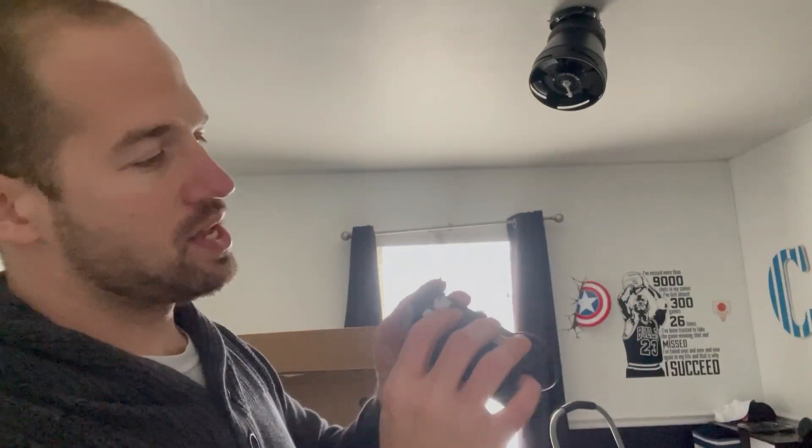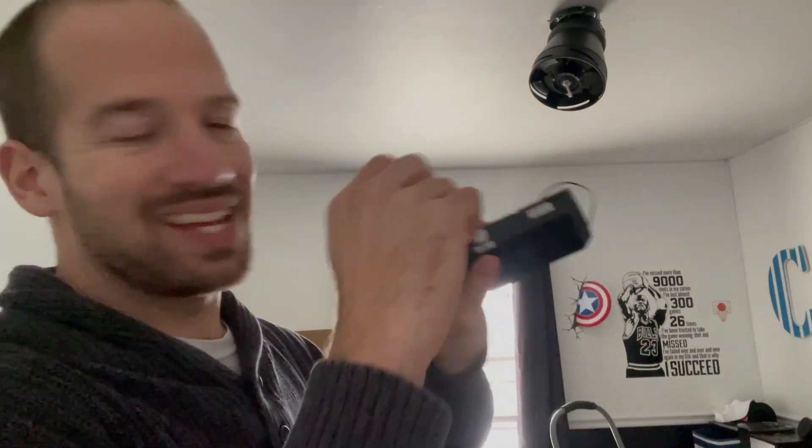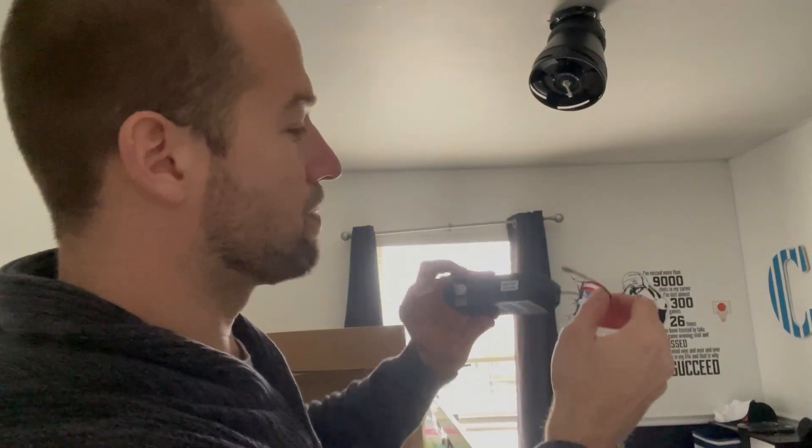Now that it's up there, take the box with the black and white wires and connect those to the black and white wires coming from the house — the hot and the cold. Then take the wire nuts and screw those on. Use the ones that come with the system — if you use bigger ones it could slip out and cause a short circuit. In this case, it's a little unique: you actually tuck the module inside the light, which I had difficulty with in the other room trying to do that by myself.